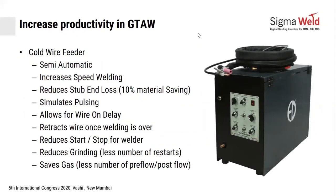There is a tool called the Cold Wire Feeder, which helps you automate the wire feeding intake process. This Cold Wire Feeder uses something like a MIG spool — you have a 15 kg spool, a 5 kg spool, or a 1 kg spool. The wire is already wound in that spool, being fed through the nozzle and coming to your torch at the top. This is semi-automatic wire feeding.